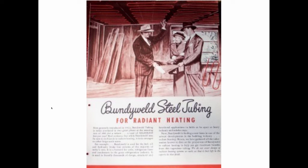And every so often somebody will show up on the wall at heatinghelp.com and say, "I've got this pipe that I can't connect to, I can't solder to, I can't weld to, I can't braze to. What the heck is it?" We say, "It's Bundy weld." It was a total disaster, but there's still some of it out there, so just be aware.